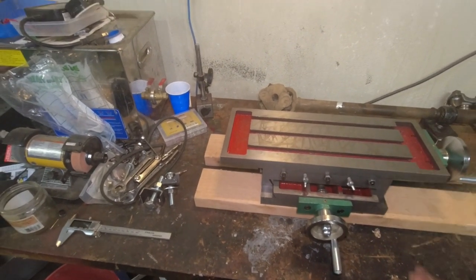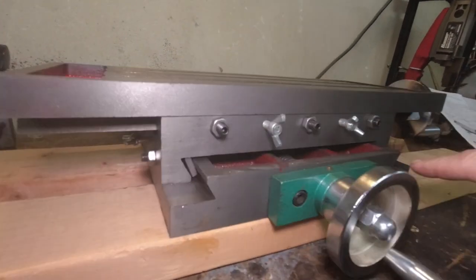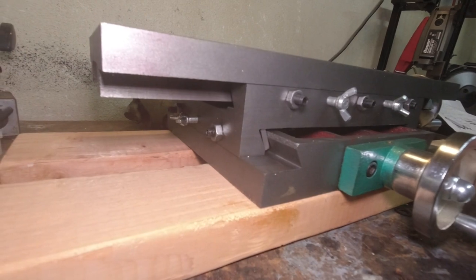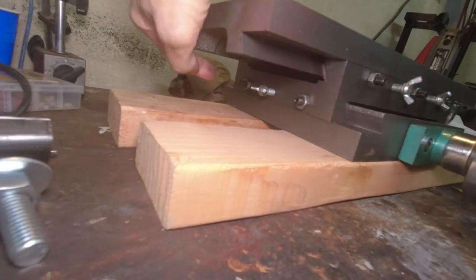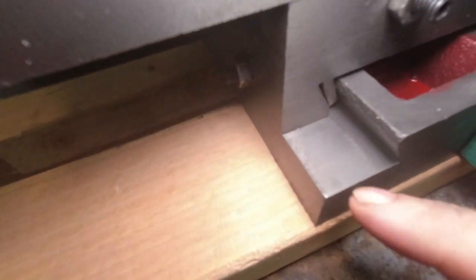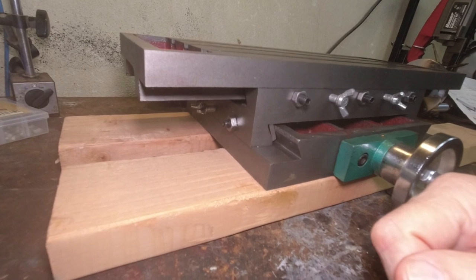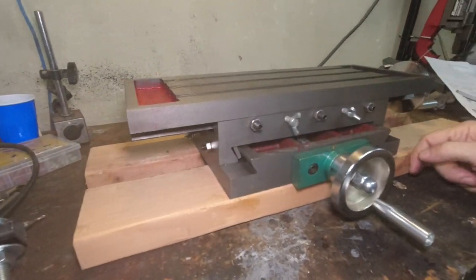It really isn't that hard to adjust. This has what are called ways and gibs. Down here you can see these are the ways — this big dovetail — the whole table sits on them. If I'm getting this wrong, let me know below; my brother was the machinist in the family, I'm a tinker backyard hot-rodder type of guy. These plates that run across are the gibs, and these adjustments underneath tighten the gib down to take all the slop out. It also needs to be lubed.